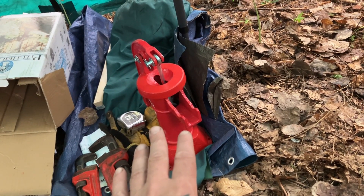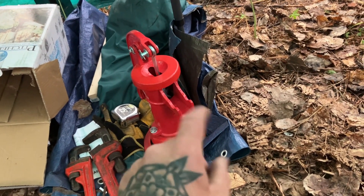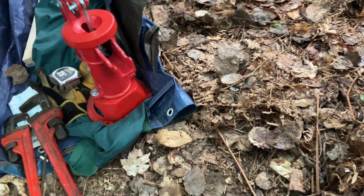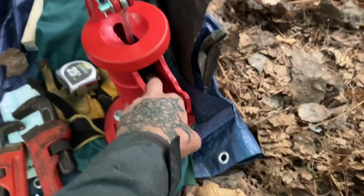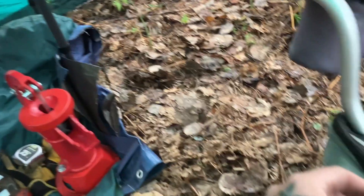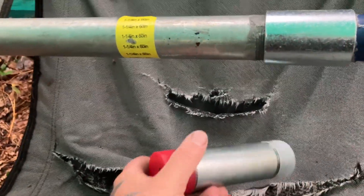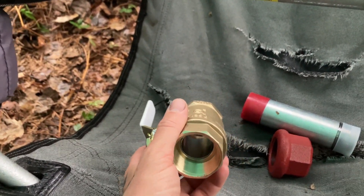Apparently the leather inside gets dry — I've never done this before — but if you don't keep it primed or attach something like this valve, you'll have to prime it every time. Basically you pour water in and let it sit so the leather pieces in there, which act like gaskets, get wet and then it works. When it's dry it can't work at all. This is an idea I got from the Bush Radical channel — totally his idea, I'm following his plan.